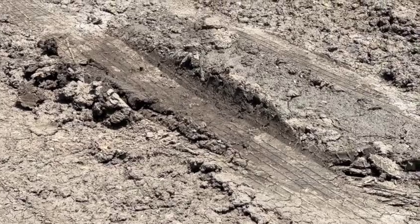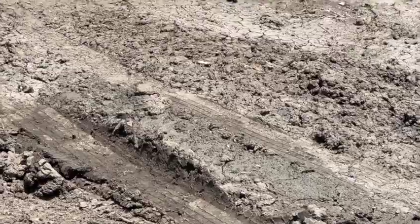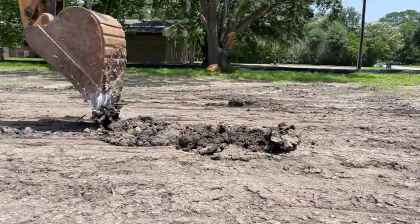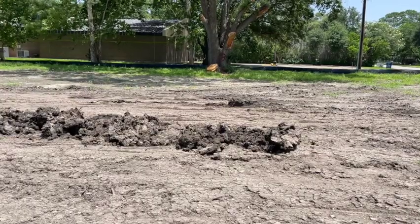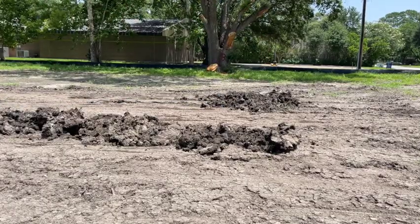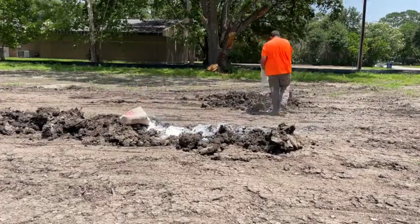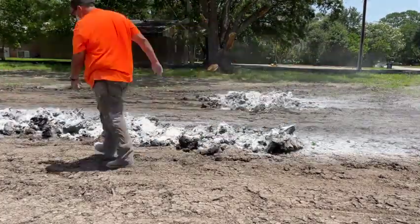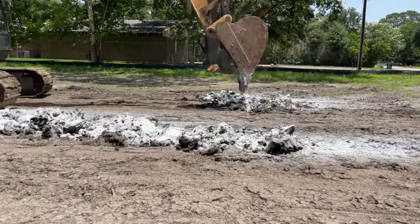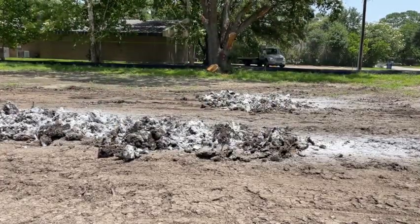So if you take the excavator, just mix it up a little bit, dump it in there, you're good to go. Here you can see the process of liming it when you don't have a mix-all on the job. You can just take the excavator, break it up like that. You want to get it down a good 6-8 inches. Go get a bag of it — costs about 12 bucks. Be sure and put a mask on; you do not want to be breathing this lime. Then just mix it up like that, give it a little bit, bring the dozer over it, and she'll set up and be nice and hard.